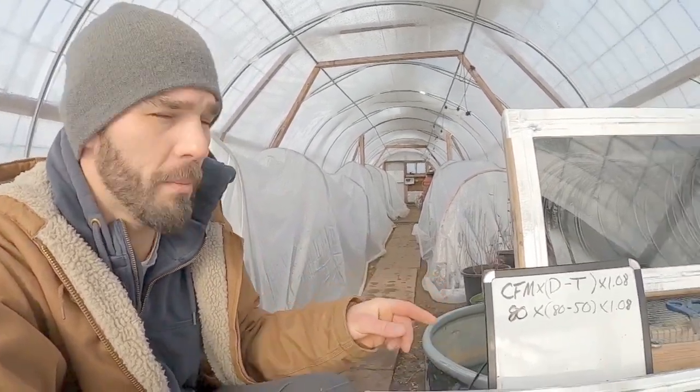Keep in mind that is on a full sunny day, so that is the maximum air we could potentially put out of this box per hour or per minute in the best conditions. Now I want to take the temps: inside the greenhouse coming into the box is about 50 degrees, coming out of the box is about 80 degrees — and it's probably going up, but we'll run with 80 for right now. So we know our transfer rate, which is 30 degrees delta. Now we've got our actual formula — we can plug our temperatures in. All you need is the intake temperature and the outtake temperature, and you've got to know your cubic feet per minute.